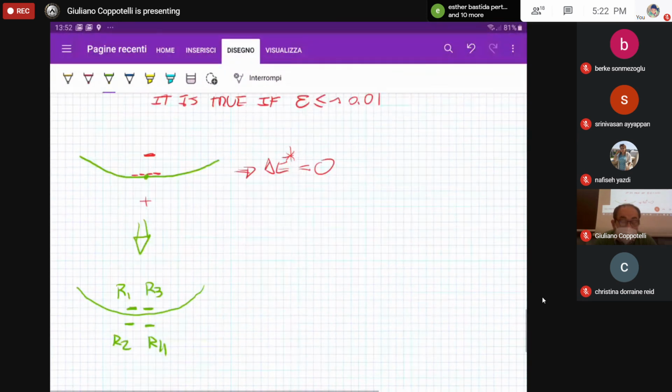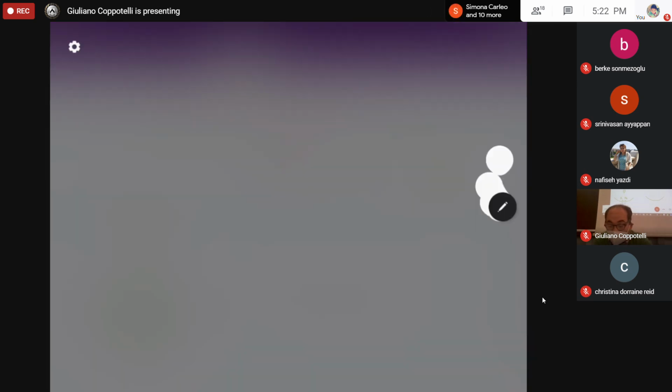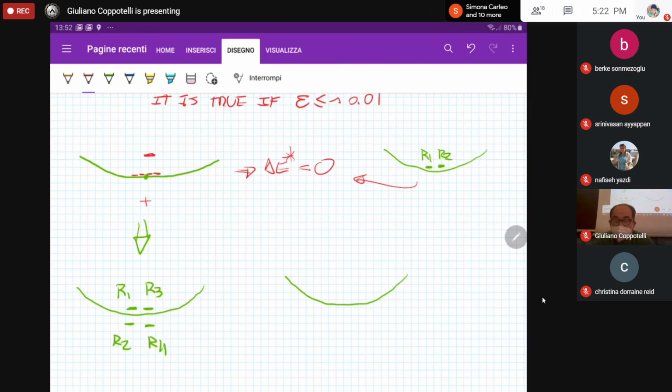Okay? Of course, the same happens when you are willing to use just 2 strain gauges at the same time. So if you want to have the strain gauge measurement with only 2 strain gauges, if you're using R1 and R2 in that configuration, then once again the output tension will always be 0, whatever the strain is. On the contrary, if you have the strain gauge positioning in this way, let's say R1 and R2, then the output tension will be different from 0.